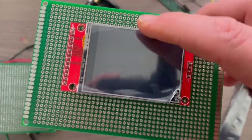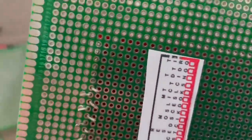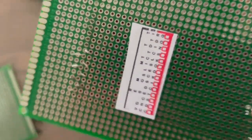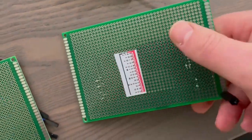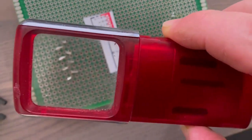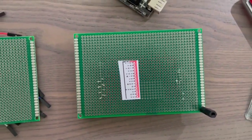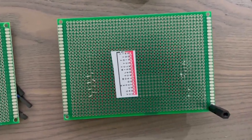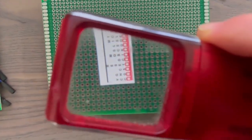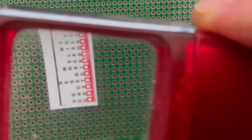This is the TFT screen and the push button. I've bent the alternate pins in opposite directions so that when I solder it I don't get a short from the solder - it just makes it easier to solder everything on. I've also glued pin labels here so I can see what they all are quite easily.